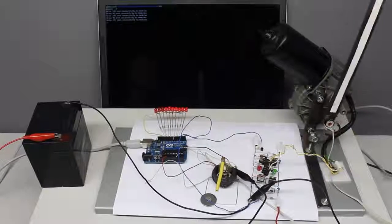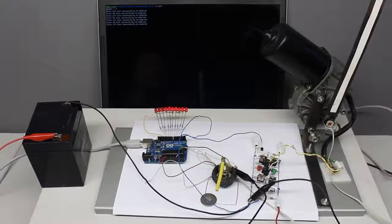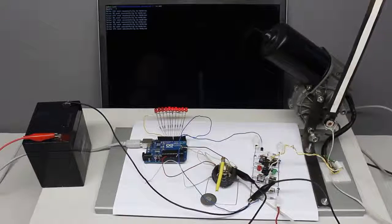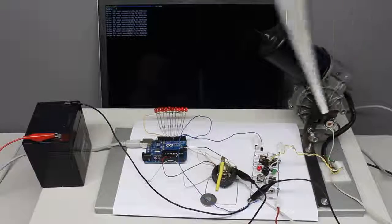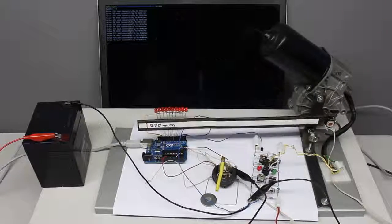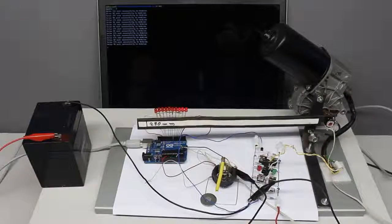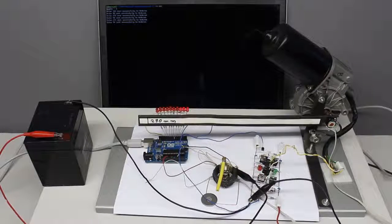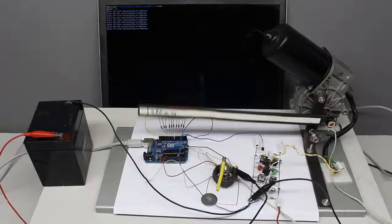If the servo is controlled by a computer through the USB interface, the setpoint can change abruptly in a wide range. Consequently, the motor is driven by full electric power at the beginning of the movement. Thus, a high current is running through the H-bridge and the power dissipation causes a warming of the transistors. To avoid those current peaks, a soft start can be implemented by software.